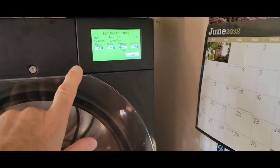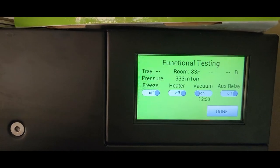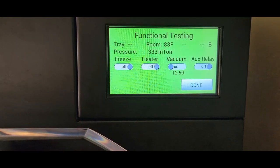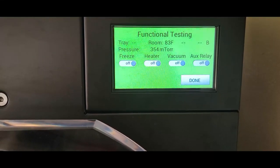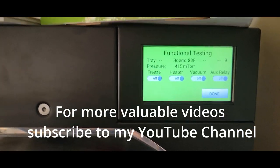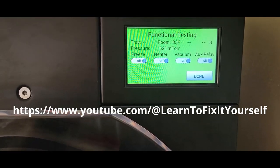At about an hour and ten minutes we're down to 334 — not quite where it should be. I'm going to go ahead and shut off the vacuum pump and leave the door closed to see if it holds. Right away the pressure is starting to increase, which means there's probably a leak somewhere. It shouldn't be doing that. It looks like it's rising pretty quick, so there's a leak someplace that we'll need to track down.